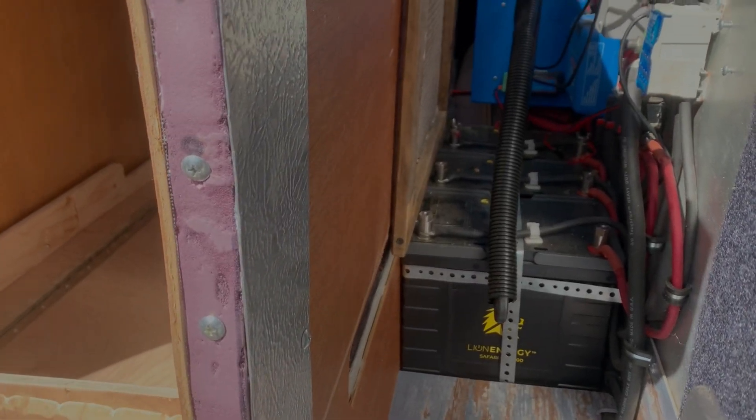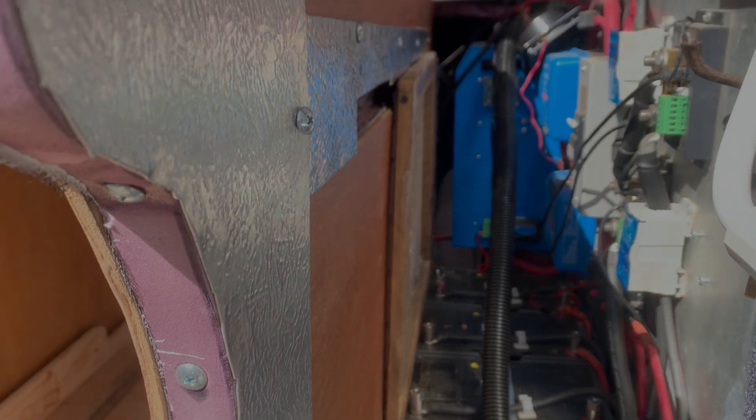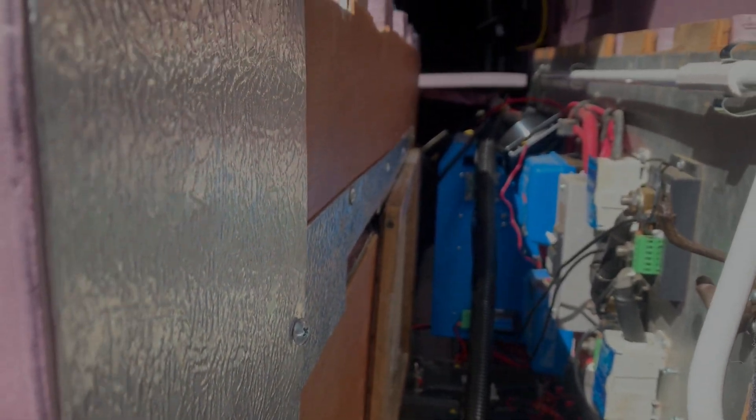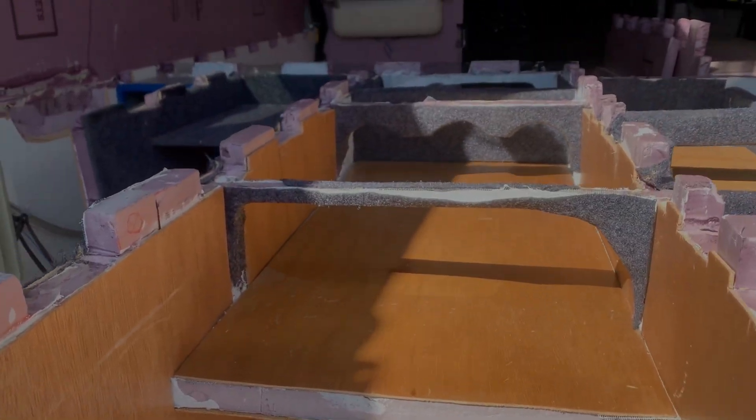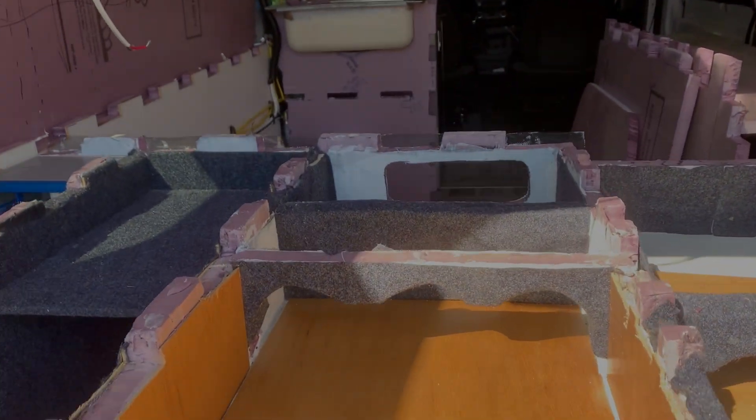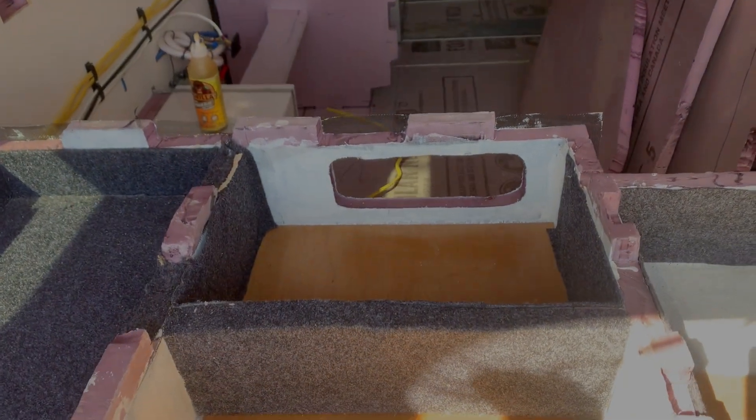Second of all, if you're going to put an eighth inch or any other structural laminate on it — like the fiberglass reinforced panels or something along those lines — that's going to help it resist bending. You don't need to use the screen on that. You can just put the structural cover directly on. That's what I did here — I didn't screen this foam before I put this on.